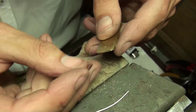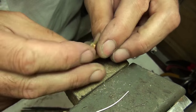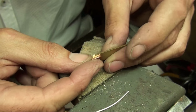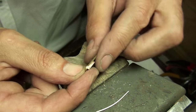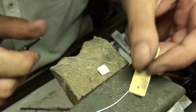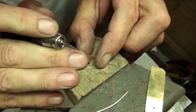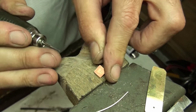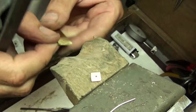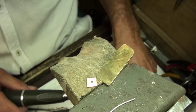You need to use the main part as a template for locating the hole in the second part. If you're making a piece of jewellery you can't just drill the two parts separately and hope they line up — you have to use the one drilled piece as a template to find where the hole should be. Before putting them together, make sure everything is nice and flat — run some emery over it. If it's a piece of jewellery, pre-polish and get it all finished first.